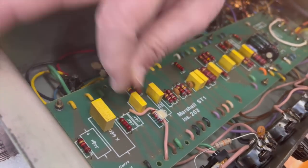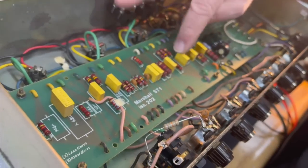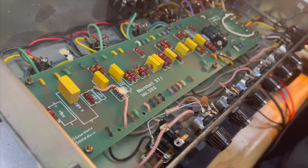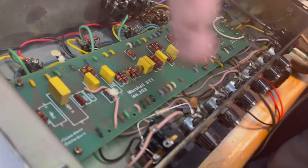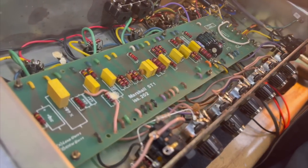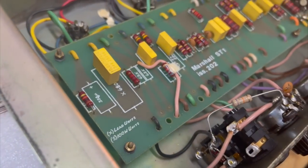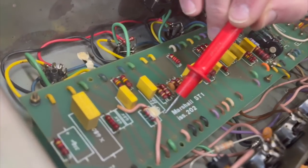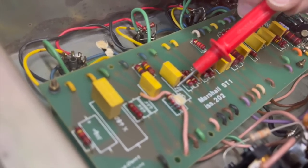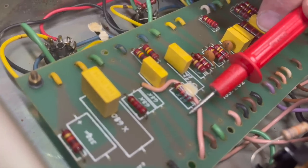And you can see here that they're using these box film capacitors. It's probably very similar in quality and behavior to the film capacitors that they used before that. They're just the current stuff that you would be able to buy, and they would evolve their circuit board designs to accommodate those. And you can see that there's a transition going on by looking at the board outline. You see here there's a big footprint for a big capacitor, and that same footprint also has an additional hole in it for a small capacitor. Yes, this is a wire tape down.